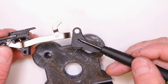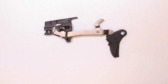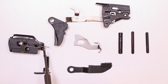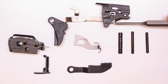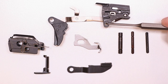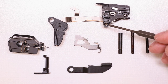If you were going to replace the trigger, you just tap out this pin and put the new trigger in — simple as that. If you guys want us to make a trigger, recommend it — I'm ready. So here's everything that you've got in front of you right now to put back into your frame. We've got our locking block with our slide stop spring, our takedown lever, our slide stop, our magazine blocking lever — that's important, easy one to miss. Trigger, trigger bar, sear housing. We've got our sear back in there, sear spring with the little cutout on the sear spring facing down. This is your sear housing pin safety — it's just a little half coil, three-quarter coil of a spring that locks into the notches on the pin. If it fell out, just put it back in — use a little synthetic grease to hold it in place.